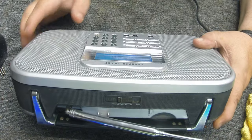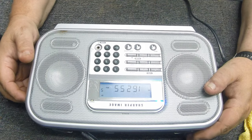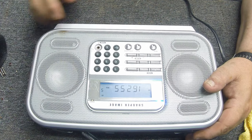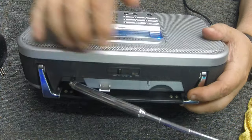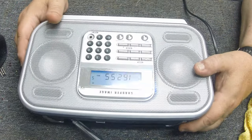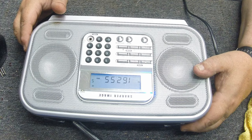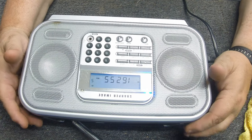Is the weather working? It says clear with a temperature of 63 — with a temperature of 74 on another reading. I am tickled. This is a good radio. I think I only paid about five bucks for it. All it needed was to get the rust out and DeOxit the selector switch on top, and we have one repaired radio. That's awesome. I like this little radio. We'll definitely go back and do a full review on it, see what she does reception-wise since we know she's working 100% now.